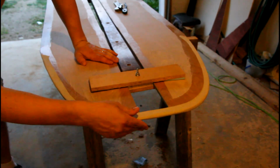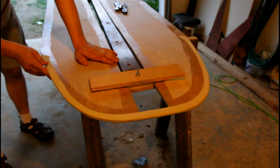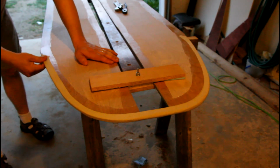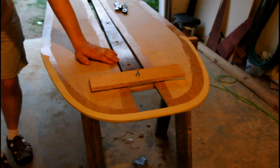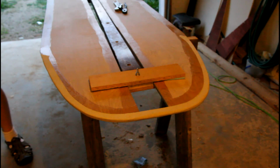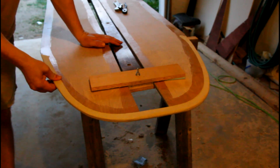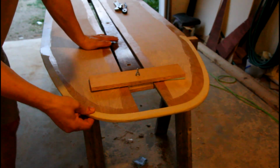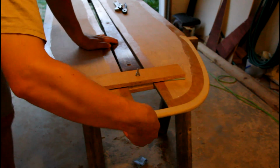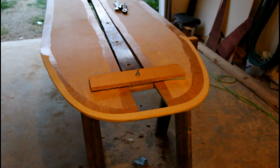Make sure you've got it everywhere stuck as well as you can. If you happen to have a J-roller for flooring, it does not hurt to go over this with a J-roller. Same as you do with Formica countertops and such. It's the same deal. You're trying to get this as squished together as you can with that contact cement. Anyways, that one went well as well.